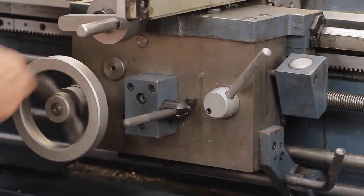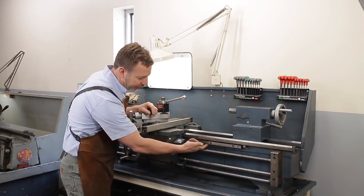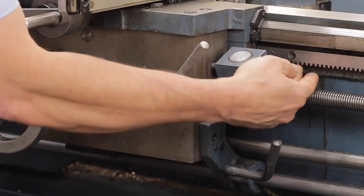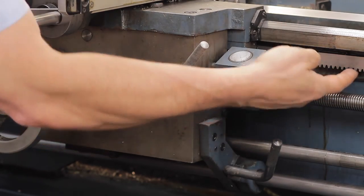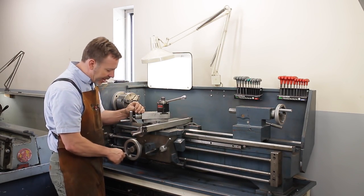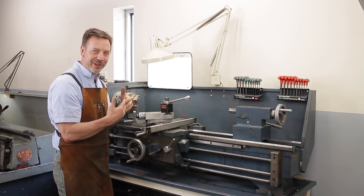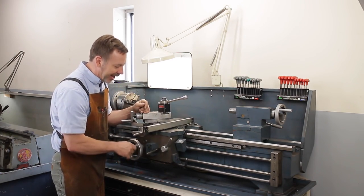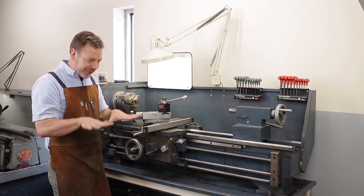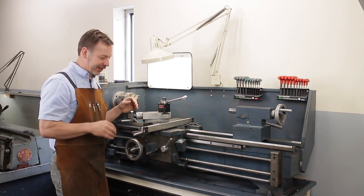Now, the first handle activates a spur gear that goes along this rack gear. And you want to check out this rack, make sure that the teeth are consistent from this side to this side. Remember, most of the wear is going to be over here. There'll always be a little bit of slop. That is just the way it is because of the way the gears are made. There'll always be a little bit of problem there. Now remember that lathe I told you about that I reground the bed on it? Well, that of course lowers the whole carriage, making this so it didn't engage, so I had to shim up the carriage to get it to work.